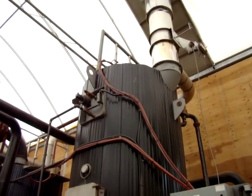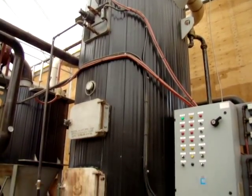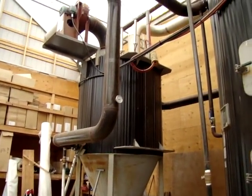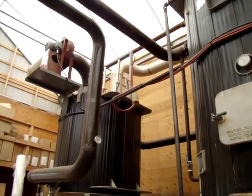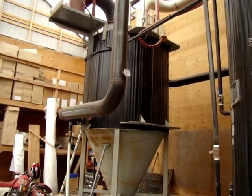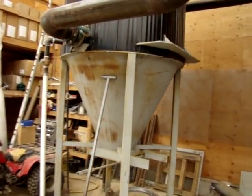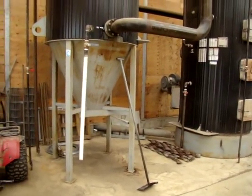Looks like they got some things to remove ash or to get off some of the fire tubes. They have a large heat exchanger — kind of a combination, it's a two-pass heat exchanger. When you get the exhaust, it comes out through that. Looks like schedule 10 stainless pipe. It goes down through two passes in the fire tubes. So this preheats the water coming in, and it also serves as a little cyclone to get what little ash you got. They've been having very good quality pellets, and so they have probably less than half percent ash.